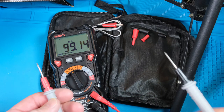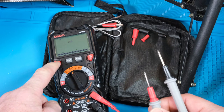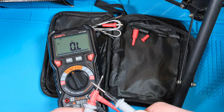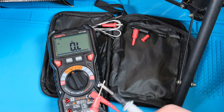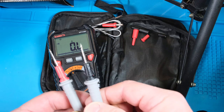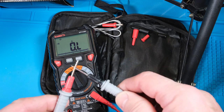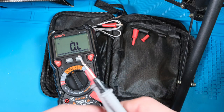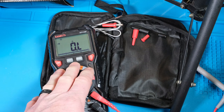Continuity - this one is anything less than about 20 ohms is going to give you a beep. You got to go in continuity - can you hear that? It's pretty loud, right? And you can tell it's latching because you get that scratchy sound - yes, that's latching. Now I'm not going to do the fire stick thing because that's ridiculous - that's actually embarrassing to watch. You should never take readings in some half-assed fashion like that. It's always a purposeful reading. By the way, the speed of the meters - three times a second it updates, pretty fast.